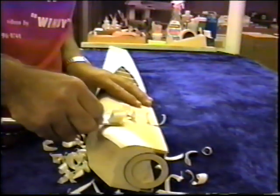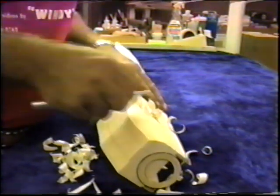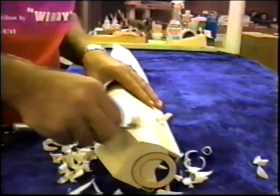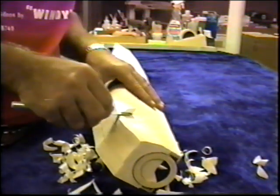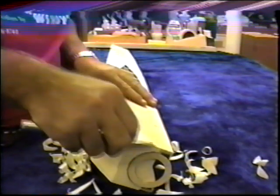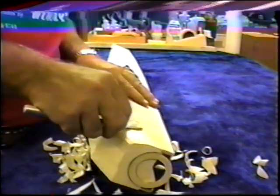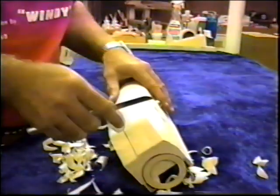And I don't want to take any more of the fuse side off than I really have to. I don't want to get the fuse side down to being a 16th of an inch. Seen a lot of people do that, by the way, and they think, oh boy, I got this really lightened up. Well, what you really have is 16th inch fuse sides, and that would probably result in not the greatest motor run in the world, even if you had a Max FP. So I don't want to take any more off than I have to, except for that last little bit where it blends in.